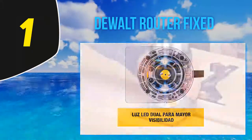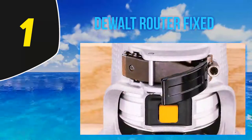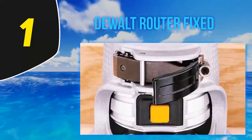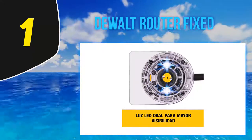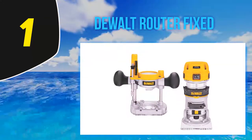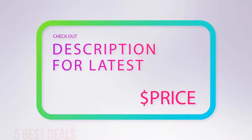The router comes with some convenient lighting features as well. The design includes two separate LED lights which are mounted near the base, which will help you out on jobs where you need to work in tighter, poorly lit places. However, there is one major issue we did find with the DeWalt DWP 611PK, and that was with the motor heating. When running at a lower RPM speed, the model works perfectly well. But on the highest RPM, the motor heats up significantly, which may cause your palms a lot of discomfort if you're planning to use it for a longer period of time. For more information and the latest price, check out the product links in the description underneath the video.